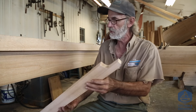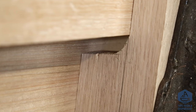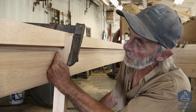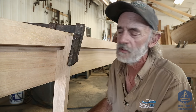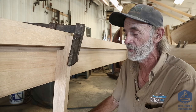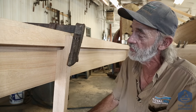We're going to put the frame in place and take a look at it. We're going to clamp this frame right into position here on a temporary basis, and you can see that half-inch gap between the top of the chine log and the very end of the frame. There really is no reason to have the frame contact the chine log right here — it doesn't do anything, and I think it's a very nice look. It makes it much easier to manufacture these frames, because we're going to have to manufacture about 30 of them, all identical, and it should happen very quickly.